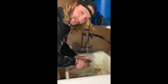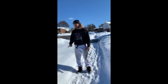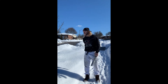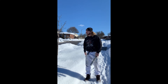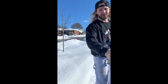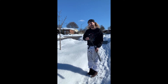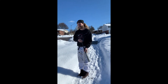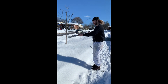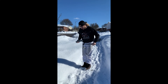That's how you wash brushes and rollers. The final step is to hit all the water out. With the brushes you just literally shake them out — like you're directing an airplane at the airport — nothing fancy to it. In the summertime you can leave them to sit out, or in the winter throw them on the client's vent. Just don't put your brushes away super wet, because if you put them away wet in the box they get all moldy. Now I've got the roller on the brush spinner — you'll be amazed at how much water comes out. That's nice and dry now.